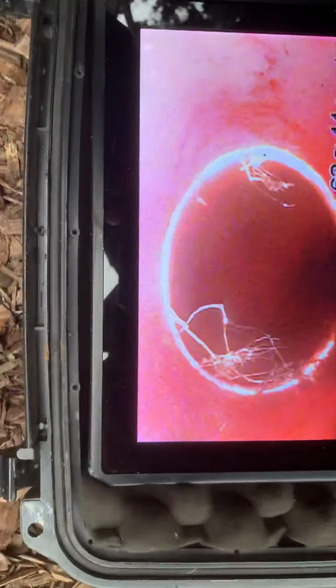So it's approximately 81 feet out to the middle of the street right there from the clean out on the side of the house here. So as we come back, you'll see another root intrusion, and that's after hydrojetting. We're gonna come back and clean those even more, but we had to hydrojet all the way through all these problems. Just keep going regularly, Daryl. We had to hydrojet through all these problems just to get the camera to go out this far. See, there's another root intrusion at that connection. That's right at the sidewalk right there, about 60 feet out. Another root intrusion. I mean, it's pretty much every connection, all the way down this sewer line.